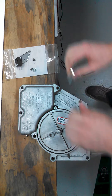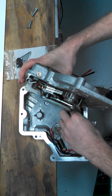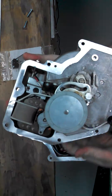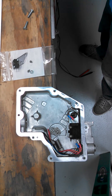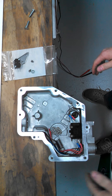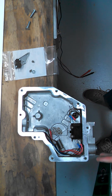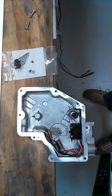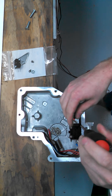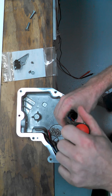Once you get the cover off, you'll disconnect the electrical connector and lay it over to the side. On a unit inside the dispenser there's all kinds of wiring coming in here, and we're going to be rewiring this following the directions you'll find in the installation manual for the SBD100. For this purpose, we're going to remove the current motor switch — you're not going to need that anymore.